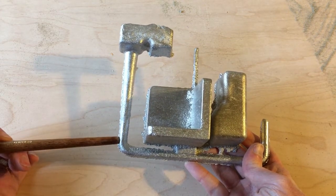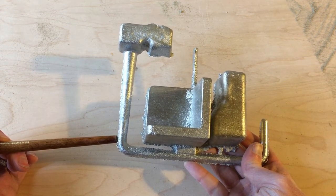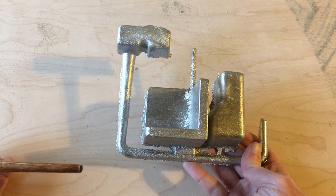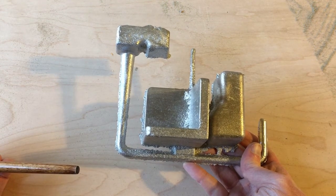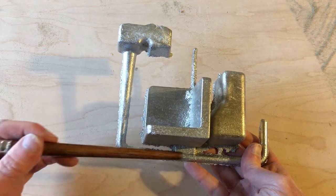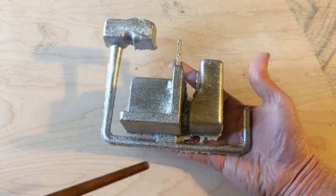In my previous videos you could see the printed water demos that I did. When this bend is sharp, it's definitely a source of turbulence, and definitely a point where you could get air entrainment into the metal before it gets into the actual mold.